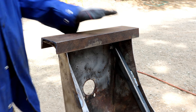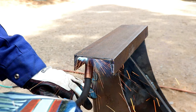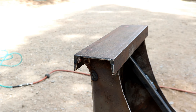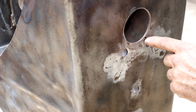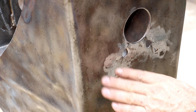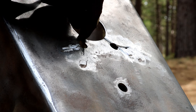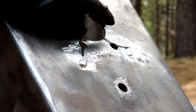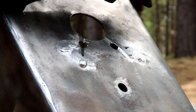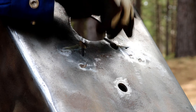We'll put the foot on up here after welding. Now up front we've got a lot of cracks around these holes, cracked right there. I'm going to put some weld beads here and then grind them down. I'll put the doubler on the back. I've ground all these cracks down about halfway through the sheet metal — this is about eighth-inch thick — so we'll hopefully get full penetration and get them welded up.